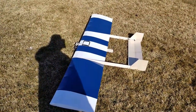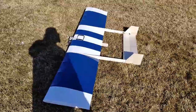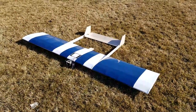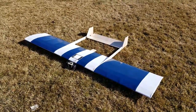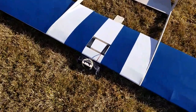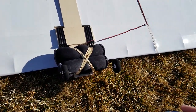At the very least I intend to build a flying model that will lift me, hopefully. This is a one-quarter scale mock-up which I've built that is weighted to scale. I spent about an entire semester in school building this. The dimensions are one-quarter scale, meaning it has a seven and a half foot wingspan. The full-scale aircraft is going to have a 30-foot wingspan, so this is seven and a half feet. The weight it's going to be carrying is four pounds, which is a one-quarter scaled mass equivalent of 250 pounds.